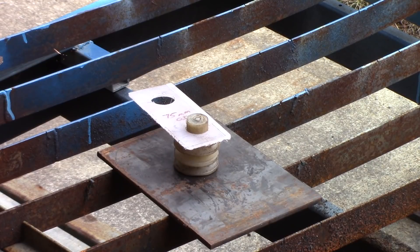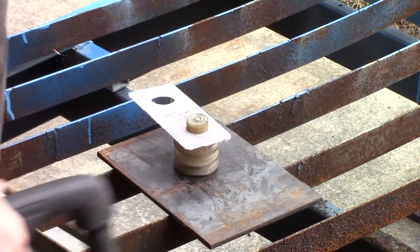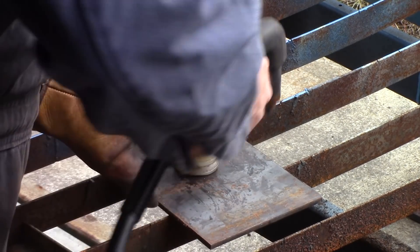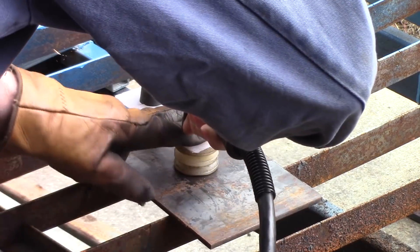I'm going to cut out parts 022 and 023 — the bits that allow me to attach the engine and the hydraulic pump together — and I'm just going to plasma cut the circles out. I'll cut the outside circle first using my poor man's radius and then I'll cut the inside. I'm going to have to freehand the inside of the small one, but I do have a radius that'll cut the inside of the larger one.